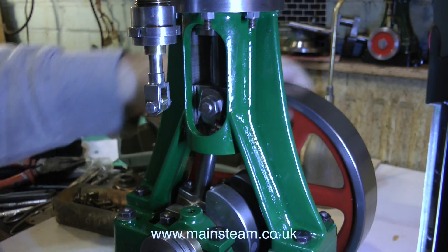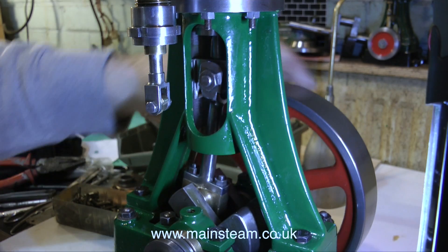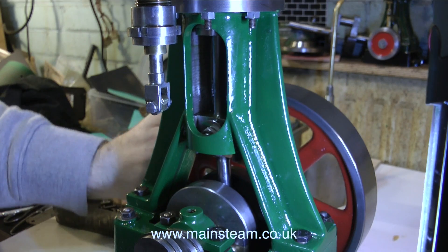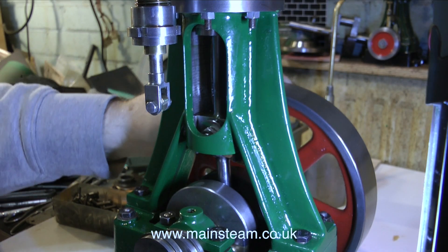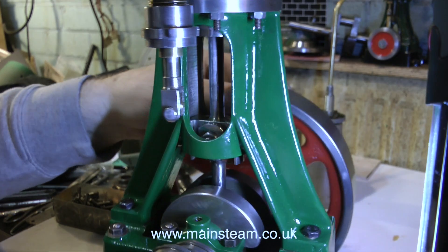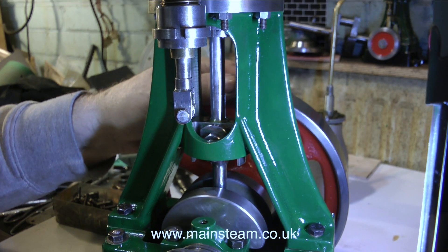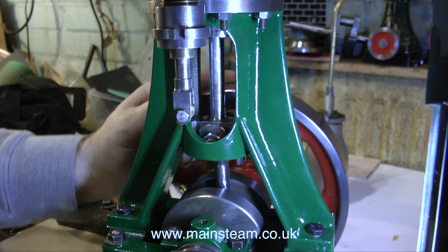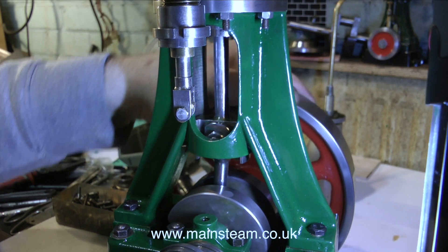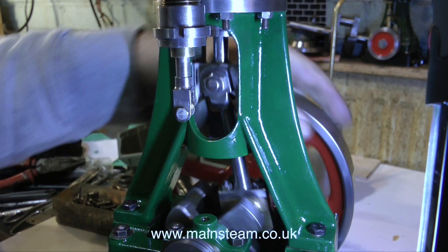I think the best thing to do with this engine — and no, I'm not going to throw it in the bin, it's a very good engine — is to fully rebuild it, put the valve gear back on, set the timing, and then run it and see whether it runs in. And after a while, if it doesn't run in and constantly clunks, then I will look further. But feeling at this, I think this should bed in once the engine's been run. As I turn the engine over, you can hear the crosshead grating up the guide — everything's just a little bit too tight. I once had an engine that was much tighter than this, and it took about a month to run it in.